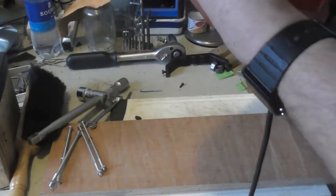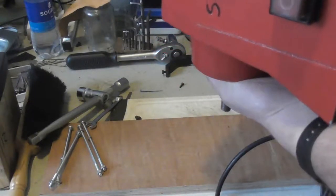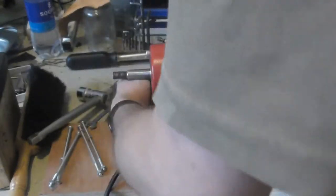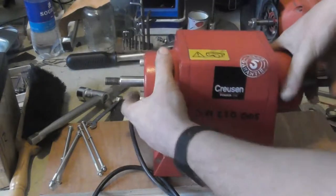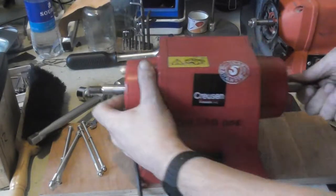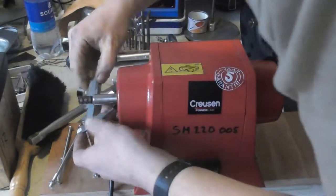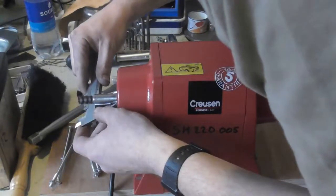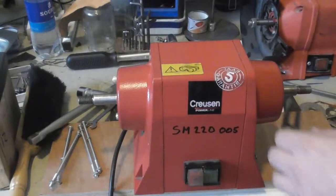And these bearings are 6202Z, two of them. I'm not sure if I should tap the axle out. Something I did notice was a difference in the shaft diameter, I think, or at least one of my bushings didn't fit properly.